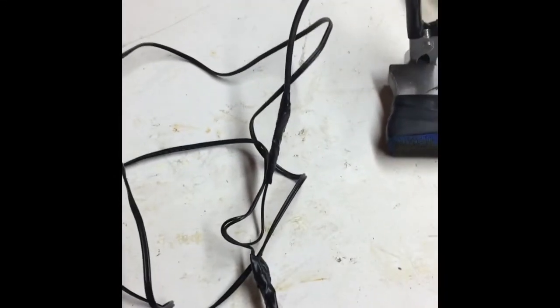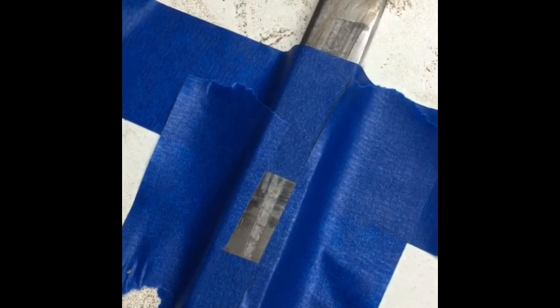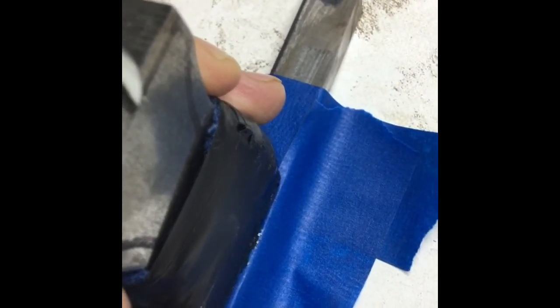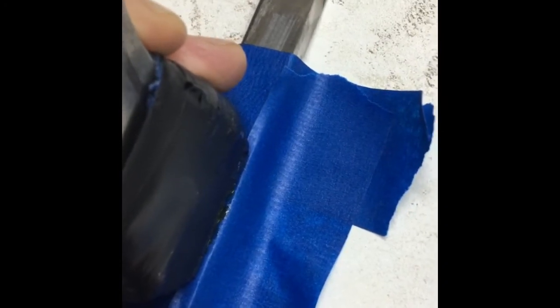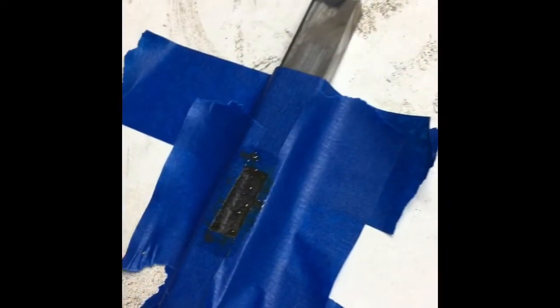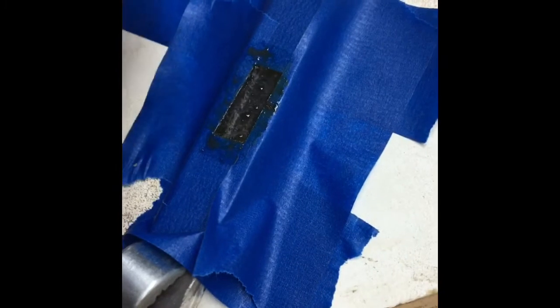I'll manufacture something a little more permanent at another time. Here I have this scrap piece of metal I've used a couple times to test different etching approaches. You can kind of see it bubbling — I usually count to ten and then take it off. Any texture you have on your pad matters; mine has a little more than normal. Someone on Facebook said they use makeup pads and that works good. You do see some etching and discoloration going on, then I'll go back again.